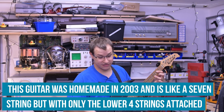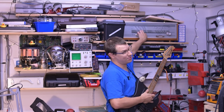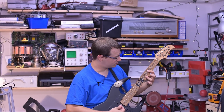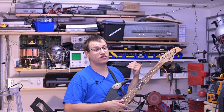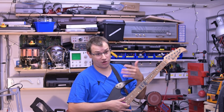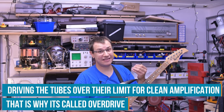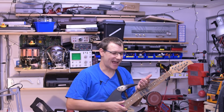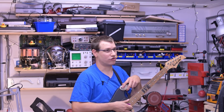That's the clean sound, but what happens when I get the volume up to 11 — to maximum? As you heard, the sound is now distorted. That happens because the tubes are overwhelmed by the input signal. The amplification is too high, the tubes can't produce a clean signal anymore, they induce noise, and they distort.